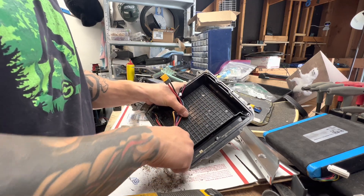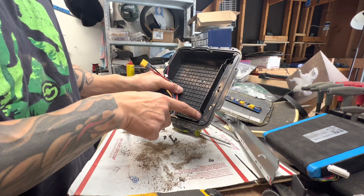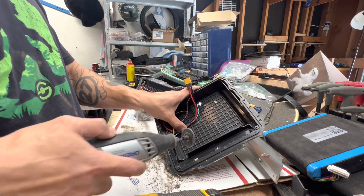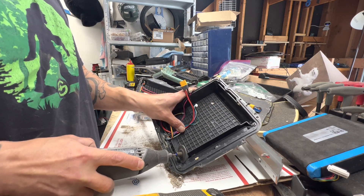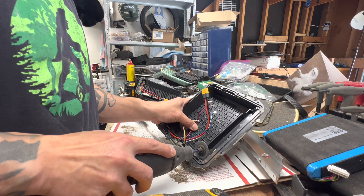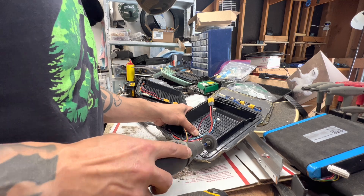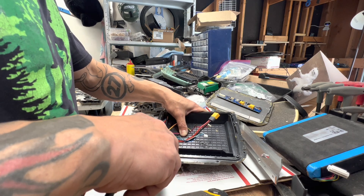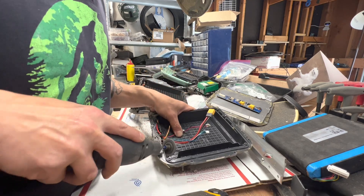What we've got to do is remove all that material out of there. We're going to move all of the balance leads out of the way and expose that corner. We're going to make sure all of those cables are tucked up out of the way because I'm going to grind down that whole corner with this Dremel here. Some of this gets sped up so you can see it better. You can see I'm just working the Dremel around that corner — I'm going to remove that one side of the wall and work around the corner to take that bite and that edge out of there all the way with the Dremel tool. I have a sanding grinding disc on there; it's for metal. The plastic on these things is so hard — that's what I'd recommend using. That way you're not worried about the bit breaking off and hitting you in the face.